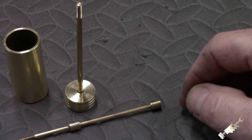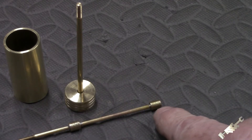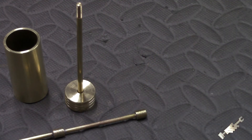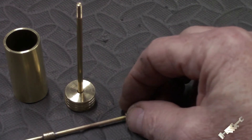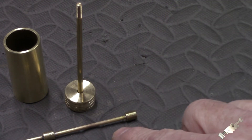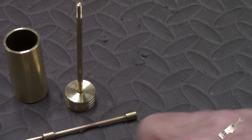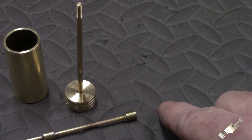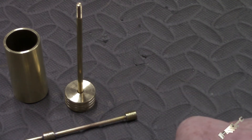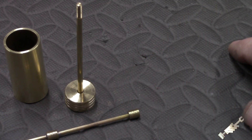Pretty simple to make. The only thing you have to look out for is the spacing between each of these valves — you want it to correspond to the inlet ports on the valve assembly. You want one port to be open to charge the cylinder while the other one allows the other head to exhaust. If that's not right, then obviously you'll have trouble with the engine running properly.